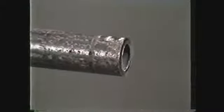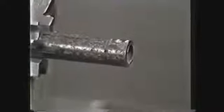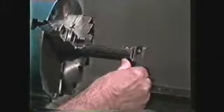The taper of the American Standard pipe thread is 3/4 of an inch of taper per foot. Nominal pipe size is a designation given to the pipe that has no reference to the exact dimension of the pipe. The outside dimension of the pipe is found by either measuring the pipe or by referring to the table in the Machinery's Handbook.